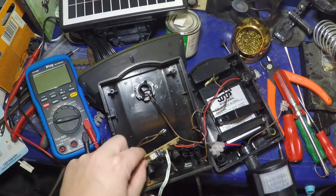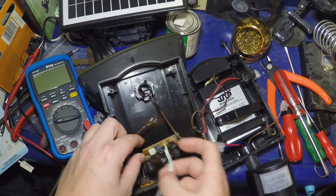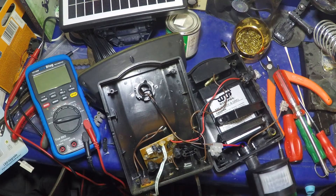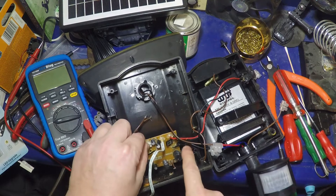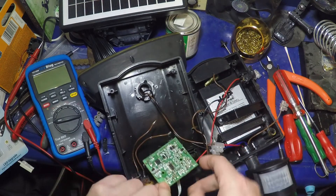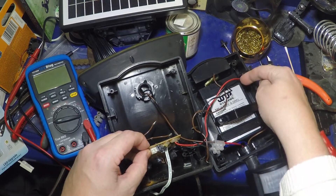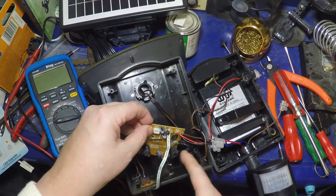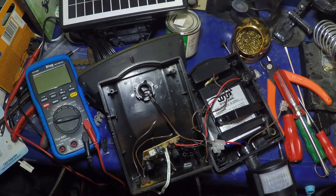Basically what I need is some circuit — I think I'm going to have to abandon this old circuit, even though it was obviously built for this PIR and already has something in it to handle the solar panel charging the battery. So there must be some circuitry in here to do the job. That's why I feel I could just take feeds from there to the battery and put them in the appropriate place on this circuit to take the feed from the solar panel, which should safely charge the battery without boiling it and also protect the solar panel.